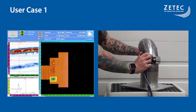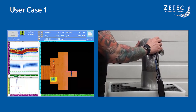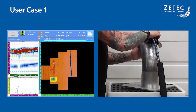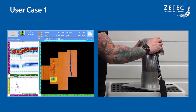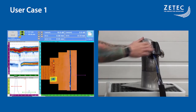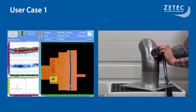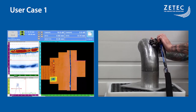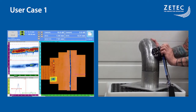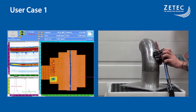We can see on the UVTouch window, on the left, how the collected data is displayed in the position C-scan, allowing the user to detect indications and know where to scan with a quick glance. The display can be fully customized, and in this case displays a sectorial scan and the A-scan along with the position C-scan. To get an optimal result, a different gate — the position in gate 2 minus the position in gate 1 — is used for the position C-scan, but synchronization on the interface can also be done to get absolute thickness readings on the sectorial and A-scans. As we can see, very little couplant is required during the scan — as low as 250 milliliters per minute can be used and still get good results.